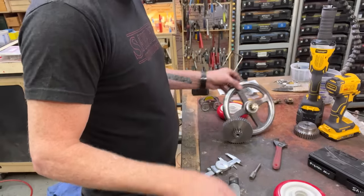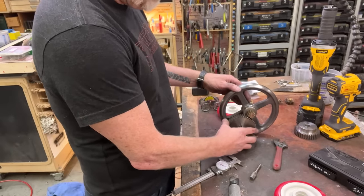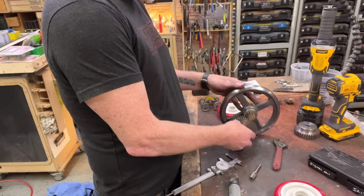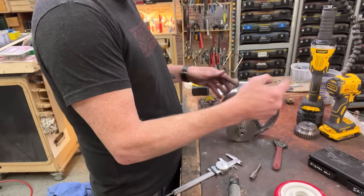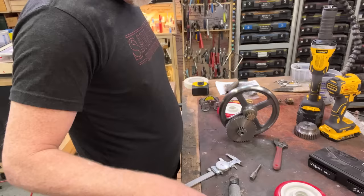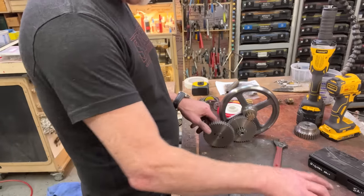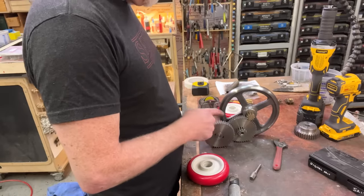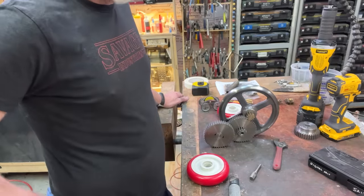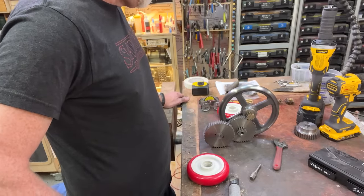So first we have the flywheel with the 10 tooth gear. That connects up to the 46 tooth. So this turns 4.6 times for every time this turns. And then, actually I should do it from this way. So every time this, Alexa, what is 46 divided by 12? 46 divided by 12 is approximately 3.8333.